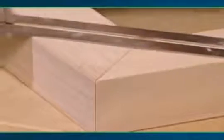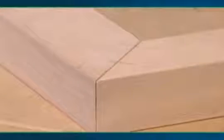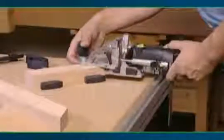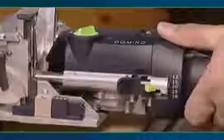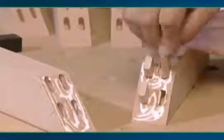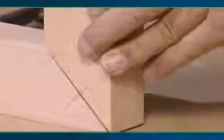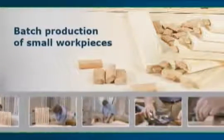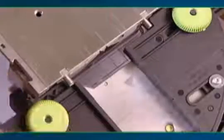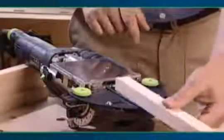Draw a scribe line over the frame sections. Pay special attention to the mortise height when arranging two rows. Secure the frame sections on a work table such as Festool's MFT and cut the mortises. Insert the dominoes and glue the sections together. Small production runs can be easily completed using the trim stop — simply adjust the trim stop for the width of your material and get started.